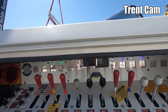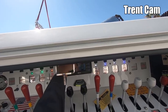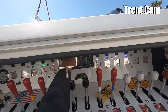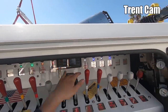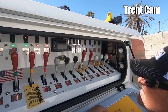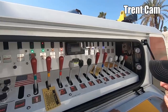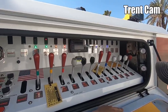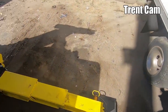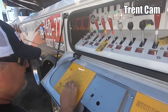Right now we're good for 33,000 with two-part. Three-part, 39,000. We're at two-part. I was just seeing if it was boom rating or cable rating. Two-part, we're at 33,000, which is cable rating. Boom's rated for 39 at this point, so we're good in boom. Or I should say tip is what we're at right now. That's our tip chart. 60-degree angle? 58, yeah, you can call it 60.